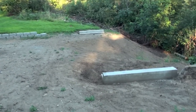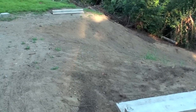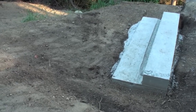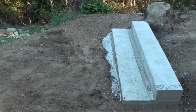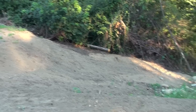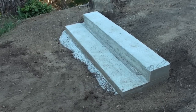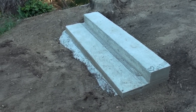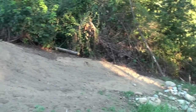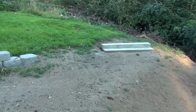Here are the steps. The way this configuration goes is I made step footings because it's going to be an arched bridge. The ends of the trusses — the foot pieces of the trusses — all the stress goes down into the corner there. It's not like the stress is laying on top; it's actually going down into it at an angle, so it needs to be reinforced in that direction. You need a lot of weight because it's a 36-foot bridge, and you don't want any of this moving or shifting over time.